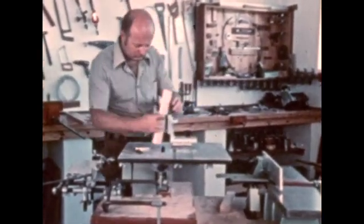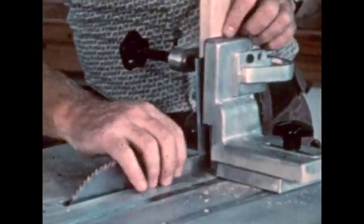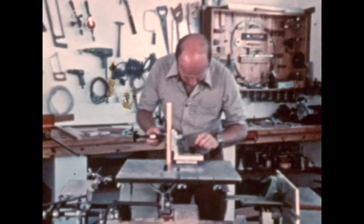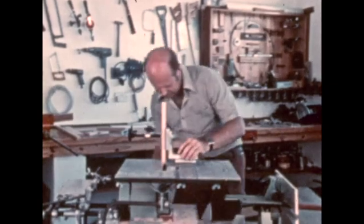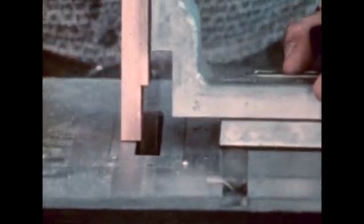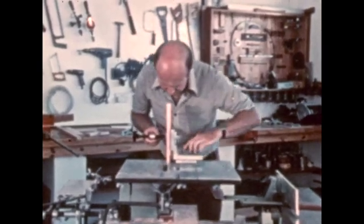First, let's tackle the tenon. The wobble washers are fitted, so the next step is to remove the miter gauge and fit the tenoning attachment. Set up the timber. It's essential to make sure that the wood is set at exactly 90 degrees. Throughout mortise and tenon work, accuracy in marking the timber is vital. Lock up the stocks and then feed the wood through. Repeat on the other side.